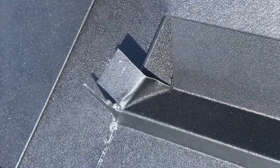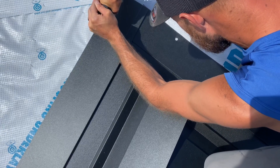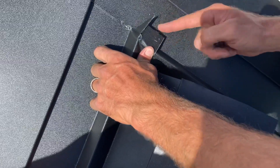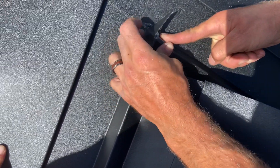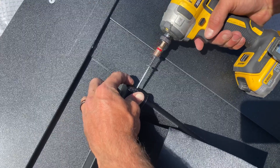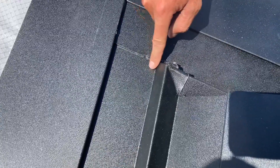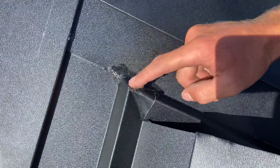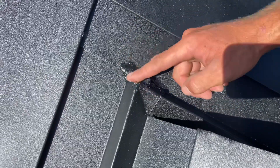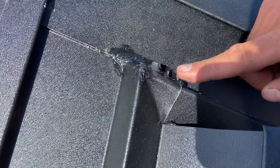Once you have it up in place, I'm going to tack it on this side. We got this side tacked, this side tacked, everything caulked. I'll put this side down first — I've got caulk all underneath there. Push that side down, got caulk on the bottom side of this one. Take a black roofing screw, or whatever color metal you're using. Make sure there's plenty there, put some around your screw to protect the washer. Leave it up around that point — this right here and this right here are your only weak spots and they're pinholes, but I always like to put a little extra caulk on them just to make sure they're never going to leak.